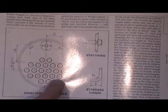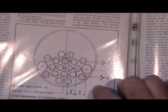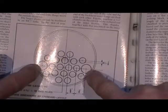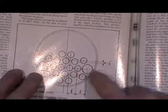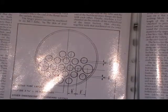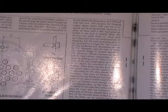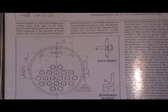But that particular arrangement, I won't be doing that arrangement. I'll be putting two superheaters in these bigger diameter tubes here, so it slightly alters the arrangement, just very slightly. So I'm over in the milling machine at the moment, marking all these coordinates out to drill the holes to make things simple, so I can just transfer everything over through my former.